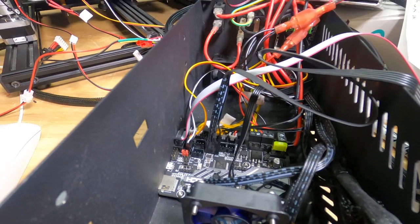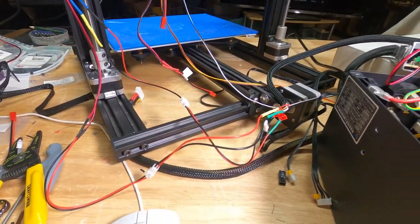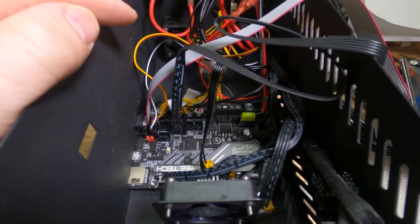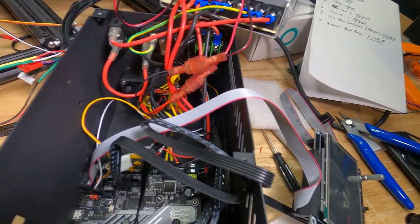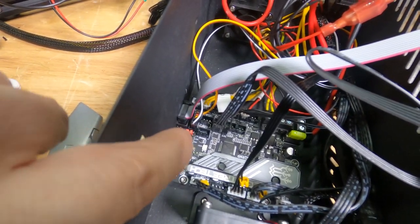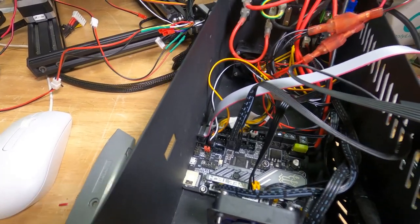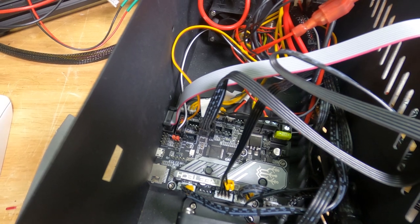The second lead screw is in. I've been doing some testing of the wires. There are a couple of always-on fans, and in the previous board they'd shoved those wires into the power intake, but with the new board it's too short, so I had to add little extension cords — got the negative and the positive sorted. I plugged in the screen, the TFT35, and it worked the first time. The BL-Touch wires are in, as well as everything else. I powered on the machine to make sure the BL-Touch turned on and off, and it did. I'll get in with a hot glue gun to secure any wires held by friction alone.